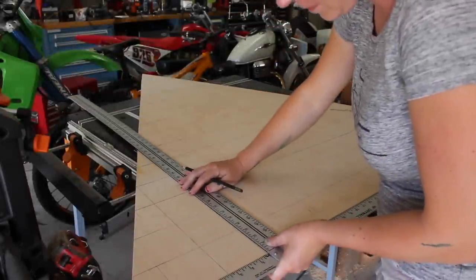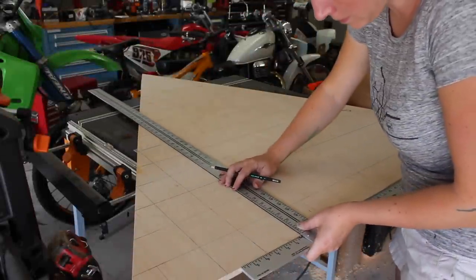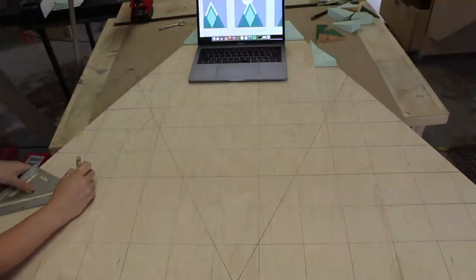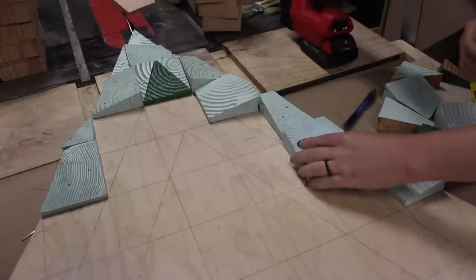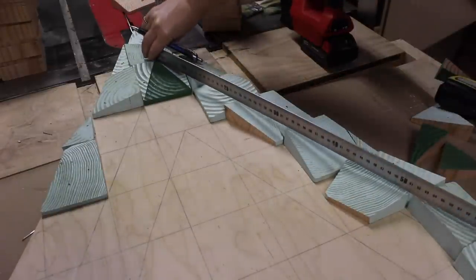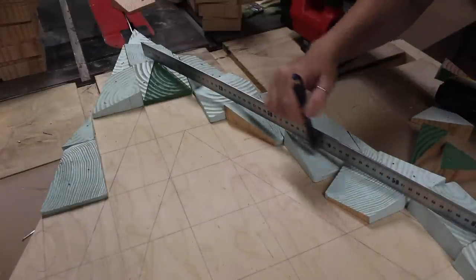This is something I probably should have done at the very beginning before I actually cut the triangle — make the grid of my pattern on the triangle itself. And while I was at it, I went ahead and made all of the other markings where the different colors come into play. This served as a great reference guide as I started filling in the different colors. I would fill in all of the spaces of a certain color, use a straight edge to make a straight line, take them over to the bandsaw and cut them all at once, then come back and glue them.